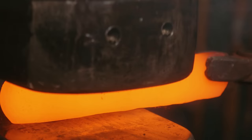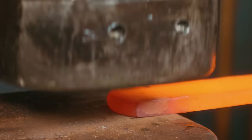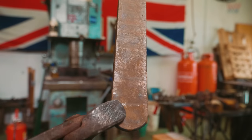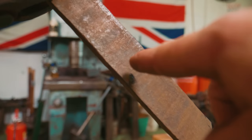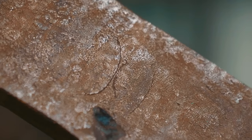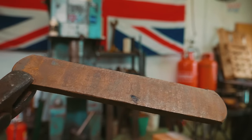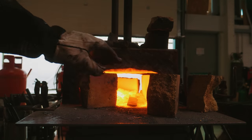Here's what it looks like right now. You'll see there's a cold shot right there from the forging, and it's also got this really interesting almost orangey oxide to it. There's another cold shot right there — that's just where a little piece of metal folds over while forging, which generally happens when I take too large a bite. This is straight off the hammer so I presume there are all sorts of stresses in there. Regardless, I'm just going to heat it up and let it air cool.